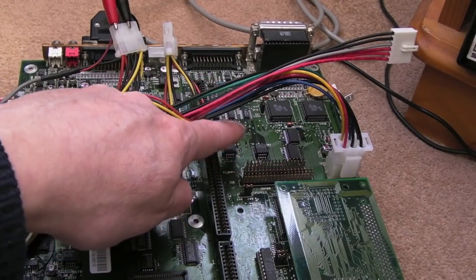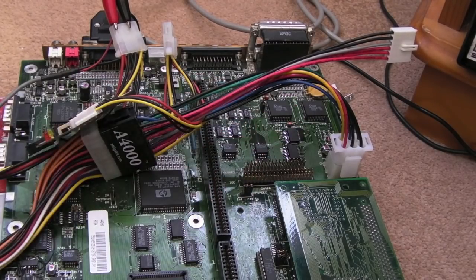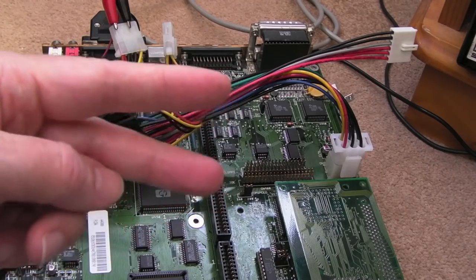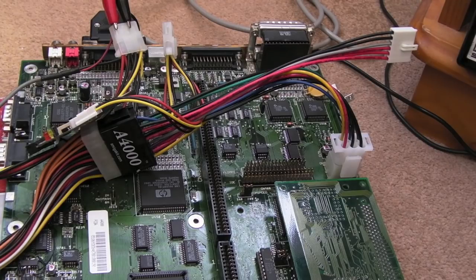And the only connection I could see around there that I needed to prove one way or another was that underscore R underscore W. It's the read-write pin, but it's like an active low. I think it's flipped. Instead of read, it's the inverse of the read-write signal. That's all it is. So it's going to be used in a few places in the system. I'd be interested to retest with the clock now. I suspect the clock's still not going to work, but you never know if that read-write pin has anything to do with the real-time clock. We might find the real-time clock works now as well.